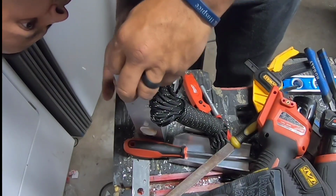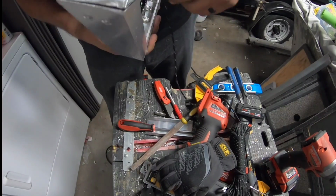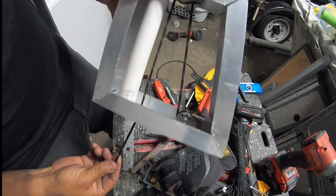We're going to be running 550 cord through this system. Get the stuff without the reflective tape inside it, because you can actually feel that tape rasping against your rollers, so just the clean non-cosmetic 550 cord will work for this.